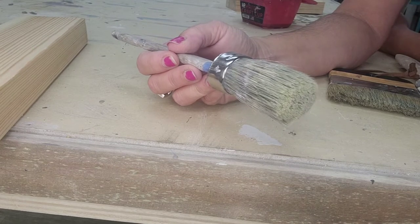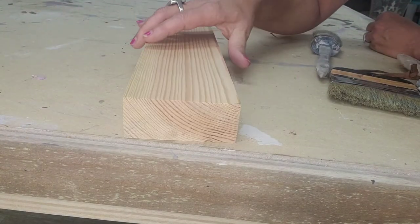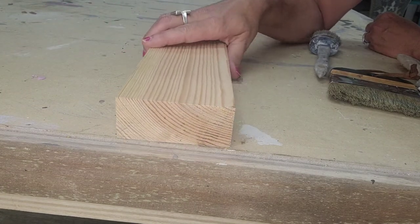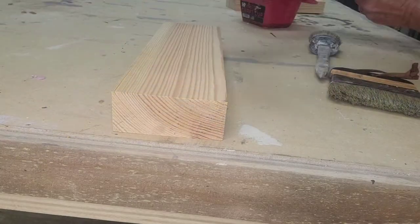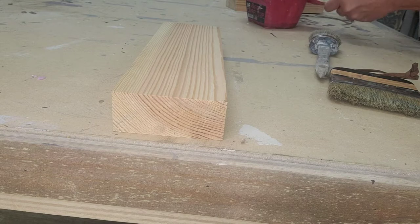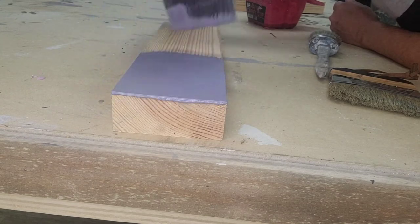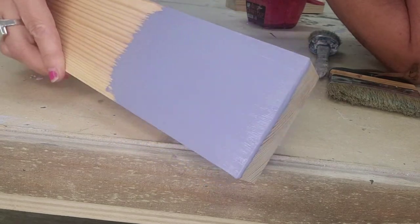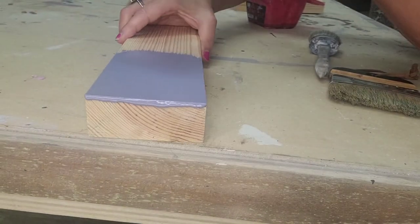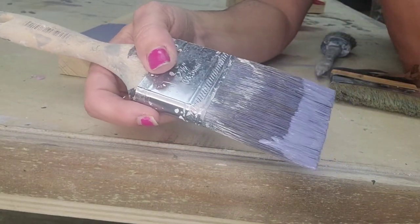I'm going to show you different techniques and what finishes come out when you're chalk painting. Get yourself some chalk paint — let me do the edge right here. With the regular bristle brush, I'll dab a little chalk paint on there. As you can see, these brushes are made for latex but you can use them for chalk painting. It's hard to go this way and it does leave lines — it leaves those line strokes. Another thing with this type of brush is that your wrist can start hurting, especially if you have a big piece that you're painting.